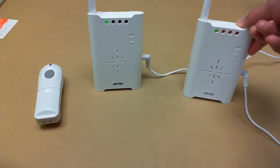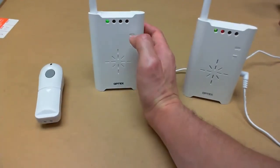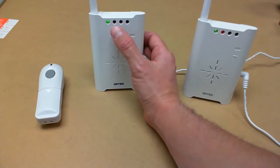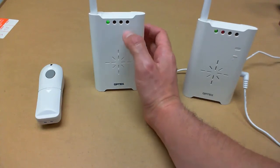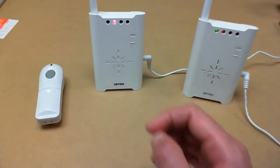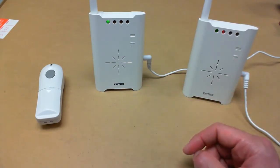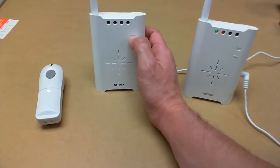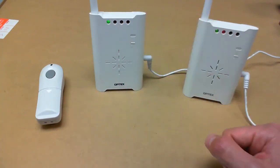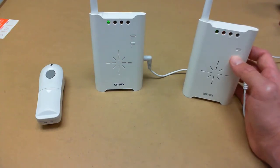Now it's time to learn the TR20U into the RC20U. You're going to press 1 twice to get into selection mode for which device you want to send the transmission code to — the RC20U. So I press it twice and then press once to send the code, a total of three presses to send the code to the RC20U. If I had a device on zone 2, I would press this button twice to move over, but I don't have any additional devices right now.